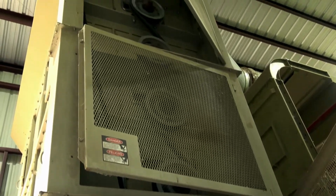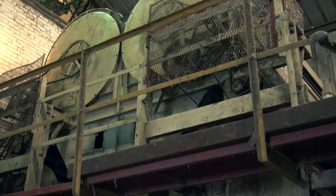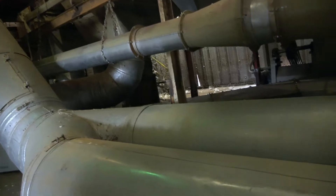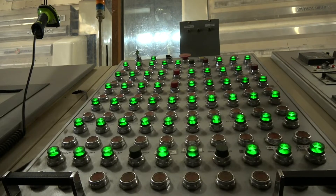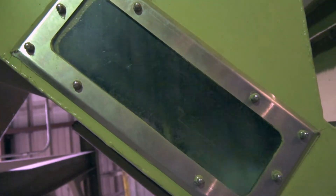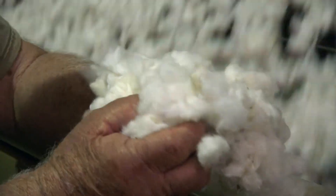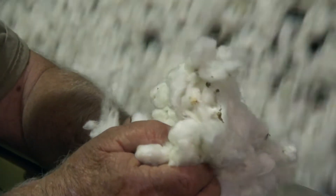But then the cotton is torn up by what they call a dispersal drum, and it's all handled by air. Air moves all the cotton practically through all of the pipes and everything. Now you will have machines like your stick machine, your incline cleaners — all of them move it by cylinders within the machine. But they all have air either drawing on them or picking up underneath them.